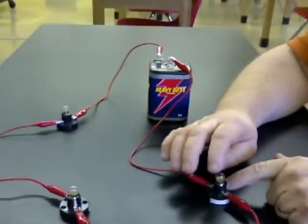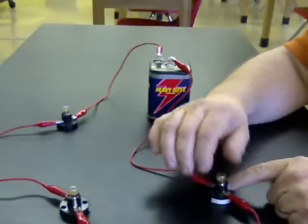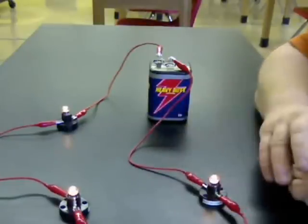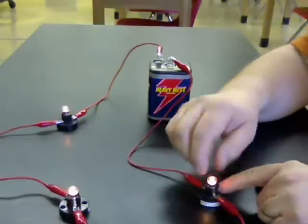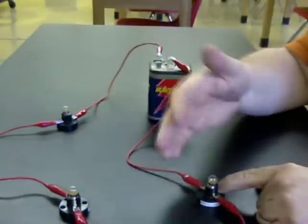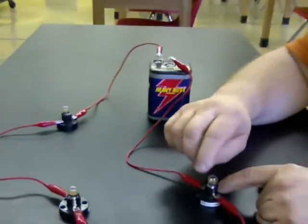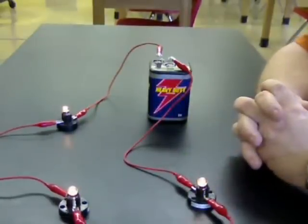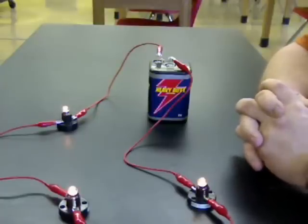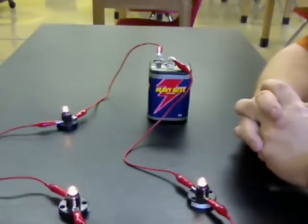This kind of wiring is typically why it's used in things like Christmas tree lights, because it's not as dependable. You wouldn't want one light in your house to blow and then the whole circuit's gone — which our houses are not wired that way, our cars are not wired that way. But in a simple or series circuit, that's what happens. It's easy to build and simple, but has disadvantages that limit how often it's used.